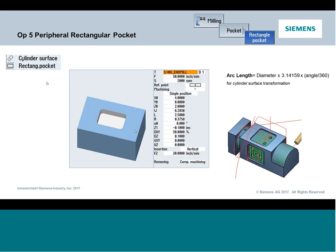Now, important, you want to make sure that you previously staged the y-axis over top of the a-axis center line, because it will use the current position of the y to denote its wrapping. It won't always just defer to center line, because it doesn't necessarily know where center line is. There's nothing telling the control physically where center line is. So if I've set it up here and I position my y, I'm okay. If you leave it off, you'll see it do it in some random location, and that's because you didn't pre-position the y. So just keep that in mind.